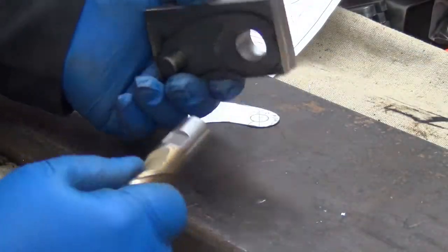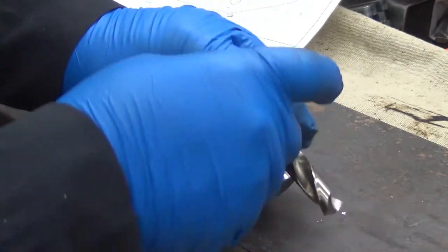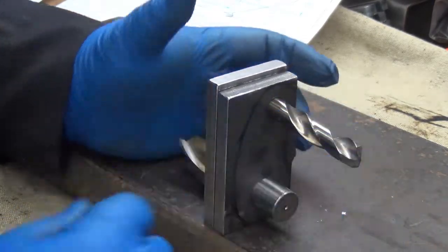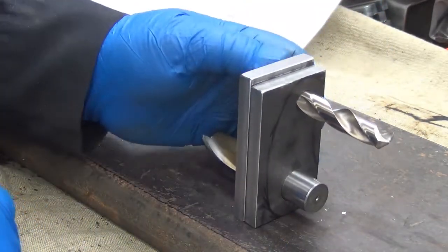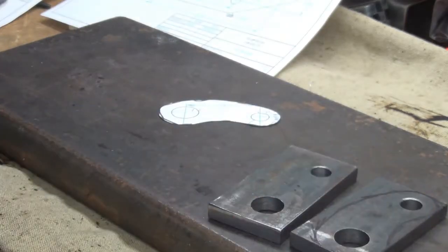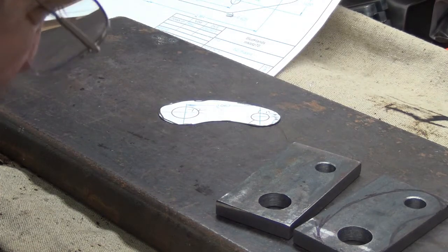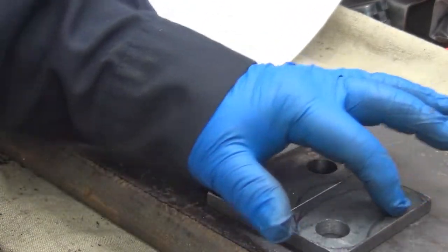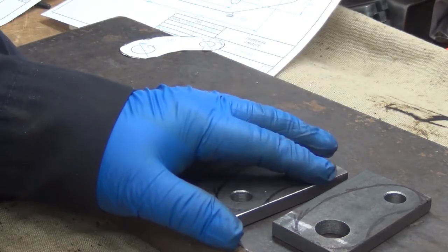This is why you get the DROs. After I deburred it a little bit, there's a three-quarter inch rod going through those two holes. Even though the outer perimeters aren't the same, the edges on here match. The ends don't match very well, but there's the half-inch drill bit that drilled the holes going right through there. You can do it with the dials, but more power to you — I can't. Those two holes are precise and I'm really pleased with exactly how they came out.